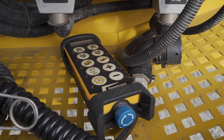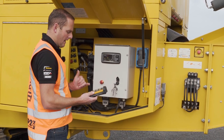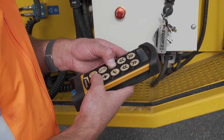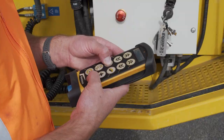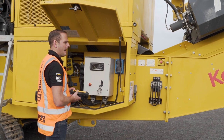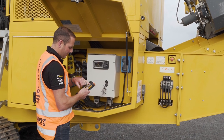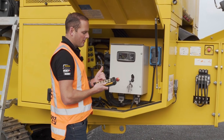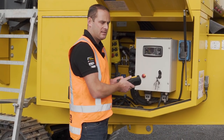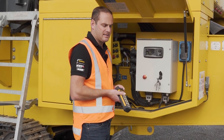Once the engine's started, we can hop in the excavator and press auto start. The whole plant will run up in sequence and we can adjust our feeder speed, our pre-screen speed, and our jaw settings while it's running — it's the only machine that will do that live. If our product's coming out a little bit too large, we can close it up and see the closed side setting on the little screen here. The great feature of the remote means you're not hopping off the excavator to come down to the controls to make your changes, which minimises the risk of breaking your leg or any health and safety incidents.